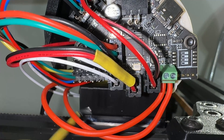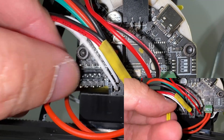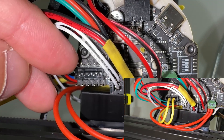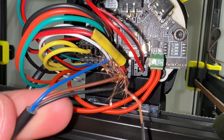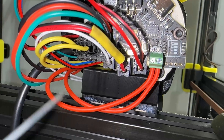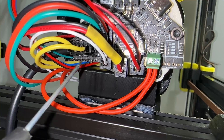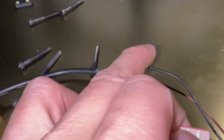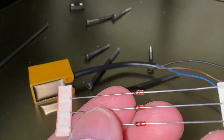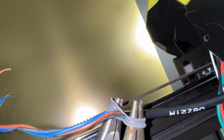The yellow X endstop wires should be connected to the second ground pin and one of the PB data pins to the right of it. The first pin is 5 volts, which you do not want to use since we are using micro switches and not Hall effect sensors. The Omron probe is one of the worst to wire since the EBB36 only provides 5 volts of power, and the probe needs 24 volts. Therefore, we can't use this 5 volt pin and must tap a 24 volt source elsewhere. This board doesn't come with a BAT85 diode, so I will need to add that to the black signal wire. This wire insulation is really thick and hard to strip, so I used a pair of pliers to twist it apart.